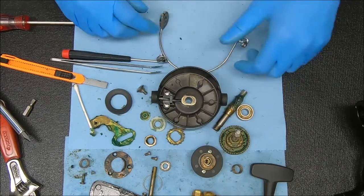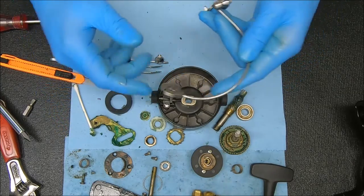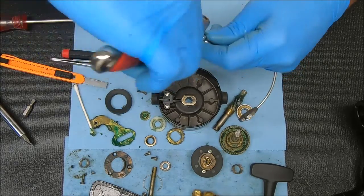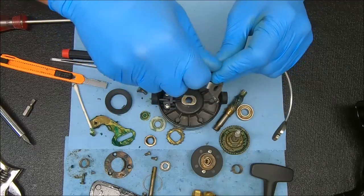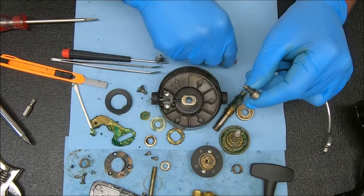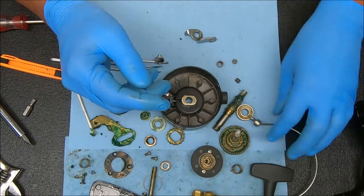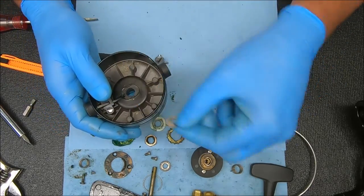I know my setup looks like this, and we obviously know this side goes over here because it has a little gap or groove that will receive it. Since we're here, let's remove the bail line roller. We're just going to do this nut — there's not too many pieces under here. Lift that up, and what you have remaining is the line roller, which can go either way. That bushing may or may not need to be replaced — I'll test it afterwards. Here comes the part that can be tricky to put back in — this is just the rotor washer.